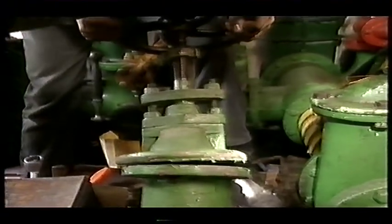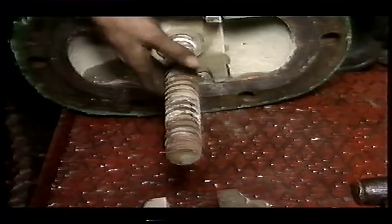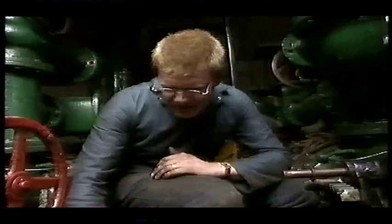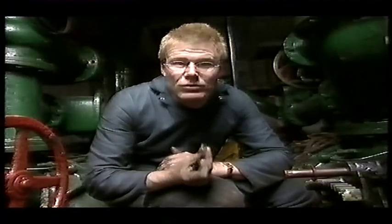In all there are 13 of these giant valves on board and they've not been apart for years. Only when he pulled them out did Jerry finally work out what was making them jam. Dave told us there was a problem with these valves and I pulled every single one in the engine room. On closer inspection the thread here looks nice and square, good and solid, but look at this — complete sections broken off. This isn't metal anymore. Most likely corrosion caused by seawater.